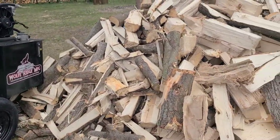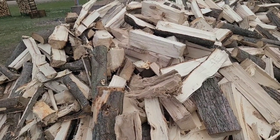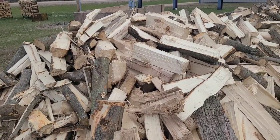Maybe I'll sell some, but I've got to get it stacked — that's going to take another weekend. Next up, I'm going to work on this year's wood. I worked on next year's wood before this year's wood, which makes no sense, but that's because this was green last fall and it needs to dry. Next time I'll be splitting on that pile over there — somewhere over that way — I'll be splitting more ash. I think I'm going to run the 12-way; we'll see. I'll run a few rounds and see how it struggles, because running some of this wood through the 12-way wedge, it was struggling bad. I maxed it out, pegged it at 3,000 PSI a few times, but the Wolf Ridge 28C handled it.